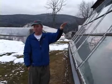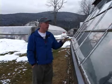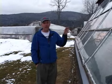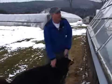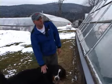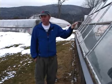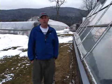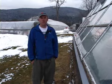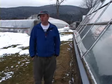A number of years later, a mechanical fan, vent, and a small Modine heater were added for convenience. This 40-by-20-foot house is so well insulated that even at 10 to 15 degrees below zero outside, it will not freeze inside — staying above 32 degrees with no heat at all. To heat it up to around 60 degrees on nights down to 10 below zero, the average cost runs only about 10 to 15 dollars a week, making it an extremely energy-efficient house.